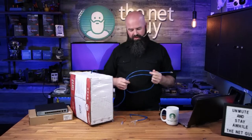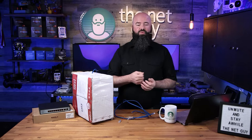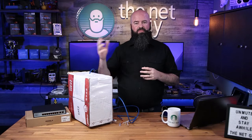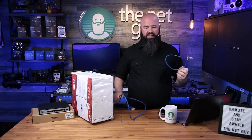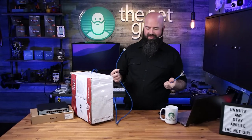CCA is copper clad aluminum — you don't want aluminum wire, especially outdoors. I've had them break just by twisting too many times; the aluminum gets brittle. What CCA means is they use the term 'copper' somewhere, but it's only on the outside as a cladding. This product from Monoprice, which I have in the carousel right now, is actually pure copper.